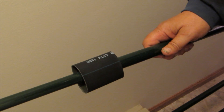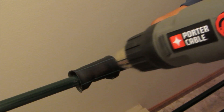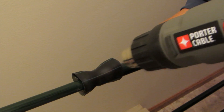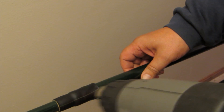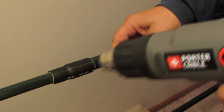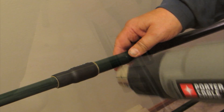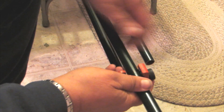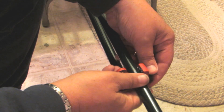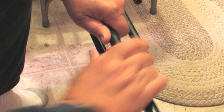When the fiberglass poles were extended, the next job was to seal them with a piece of shrink-wrapped tubing that was coated on the inside with a hot melt adhesive. A heat gun was required to provide the temperatures to melt the glue. The next job is to measure the length of the fiberglass pole and trim them all to an equal length. For this job, I used a simple plumber's tubing cutter.